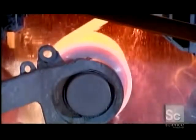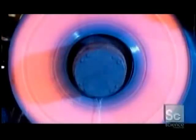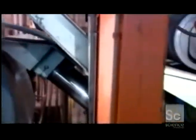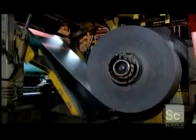This spool coils the strip tightly like a roll of toilet paper. Then the roll is transferred to another station. Here, the steel goes into a hot acid wash that removes the scale that's built up since the last cleaning. Burners in this machine also heat the steel, then slowly cool it. This relieves stress in the metal, softening it for further processing.